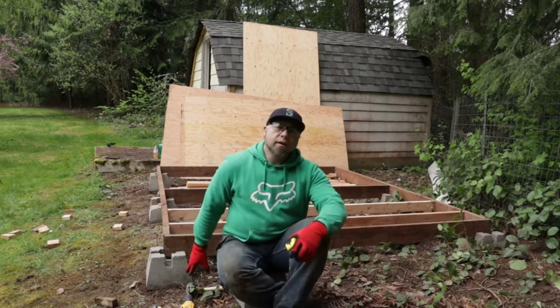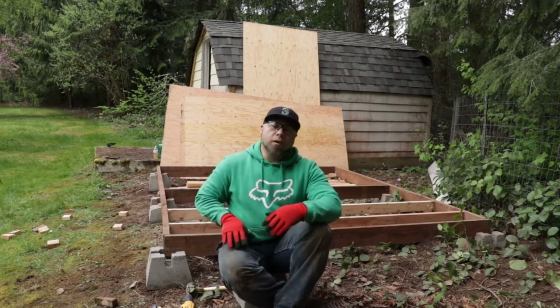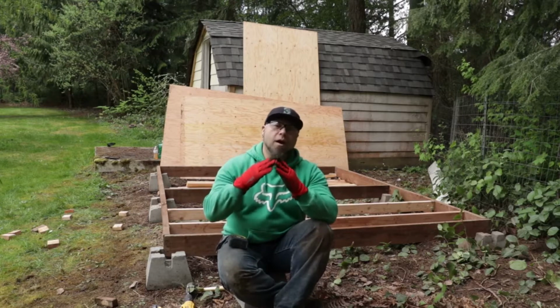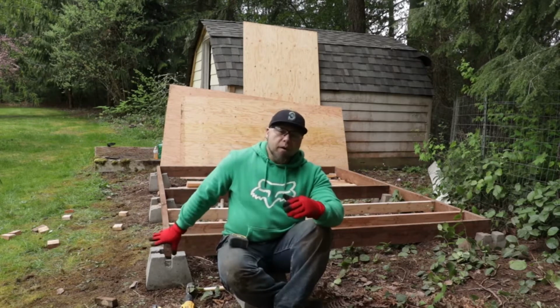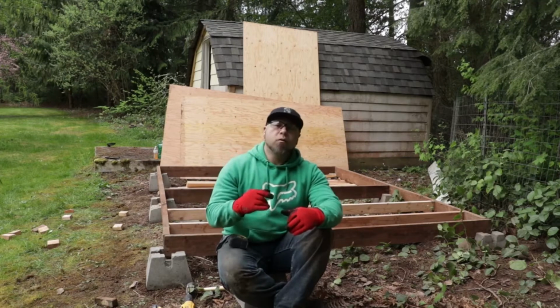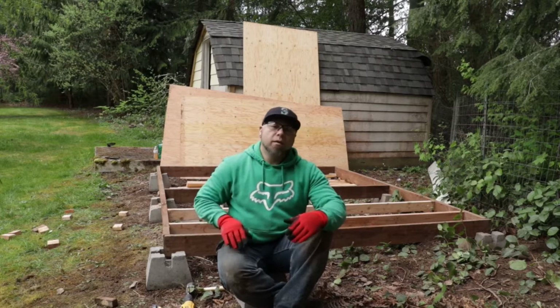And so I got to looking, and we put the angle into this corner and looked, and the concrete block was holding things at an inappropriate angle. It was off by quite a few degrees. And so we took it apart, swung the concrete block around, put it back down together, put it up tight, and now we're measuring exactly 156 3/4 of an inch from opposite angled corners. So everything is exactly where we want it to be.